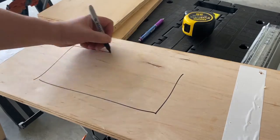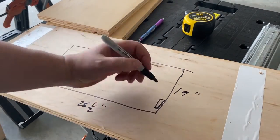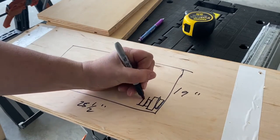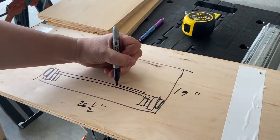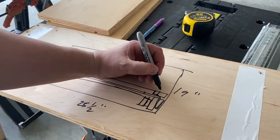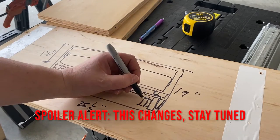Here is the opening everything needs to fit in — it's 25 and a half inches wide and 19 inches tall. We're going to take some heavy-duty slides, three-quarter inch thick, rated for 250 pounds, put them on the side, get some three-quarter inch plywood runners attached to those, then take some half-inch heavy-duty slides, put in some more plywood, then a plywood top. Then we have a lazy susan — it goes on there, then a one-and-a-half inch butcher block on top with holes drilled in for the Blackstone feet. It's approximately 12 inches high with about a 7-inch drawer that clears access for the water heater.